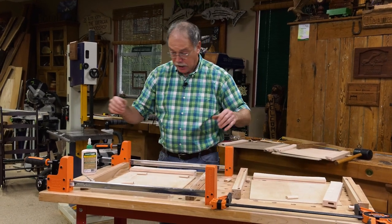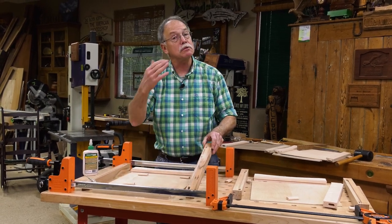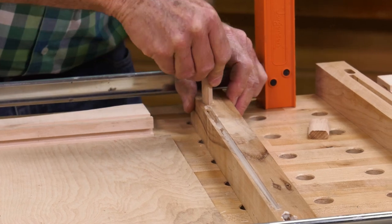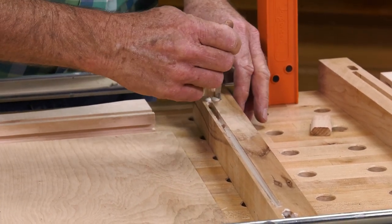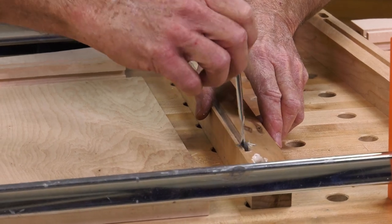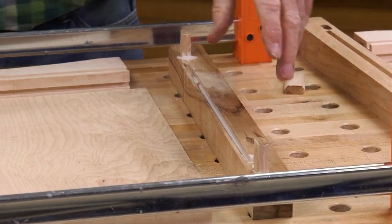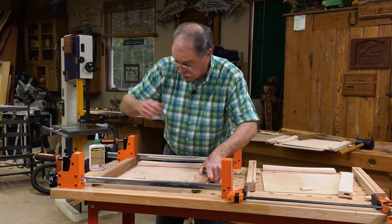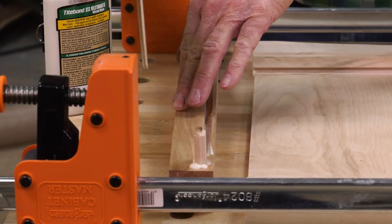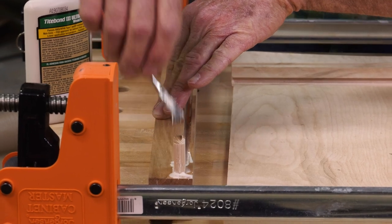So the curves go down, and I have glue in the sockets. I even lay a thin bead where the plywood's going to go, because the plywood does not expand and contract — it's stable. I want this to help square it up. So wherever there's a mortise, I have glue. If I get too much squeeze-out, I just brush it off with the acid brush. For the glue-up, I don't put any glue on the loose tenons or the dominoes, because when you push it in it'll come right off. When you do this a lot, you get good at knowing exactly how much glue you need in those captive joints. It's going to carry a lot of weight and torque over time being an ottoman, so you want to get a good glue-up.